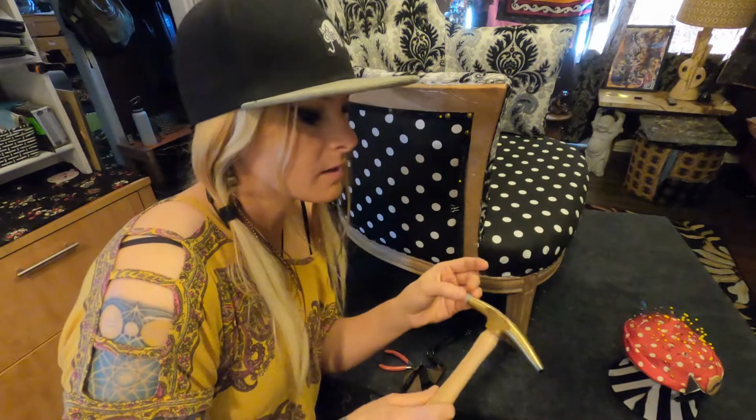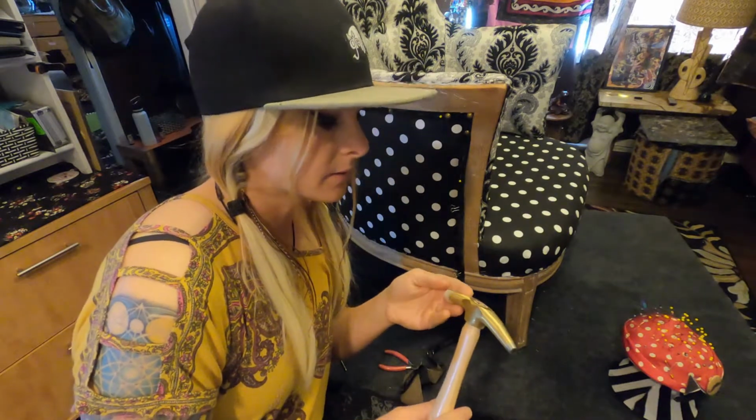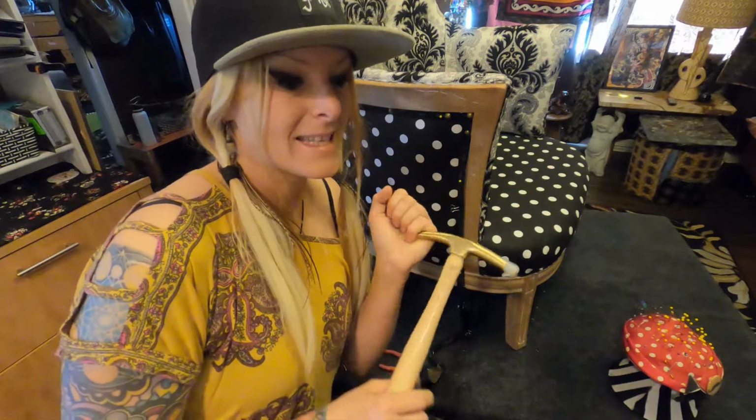I like to start mine with the metal and then switch to the nylon because, depending on the quality of the tack, sometimes it either dents the tack or it scratches it, and so I want to try to minimize that. I think maybe for really experienced upholsterers who are the best at doing decorative tacks, they can use all metal and not even get a scratch on there.